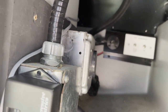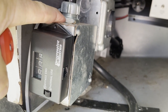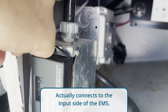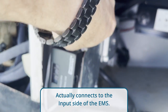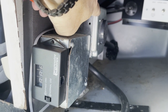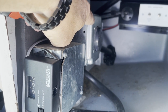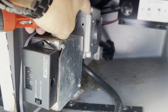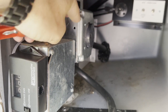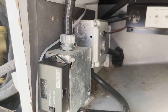So my connections are in this small bay here. Basically this is the junction box that connects the shore power cord to the electrical panel inside of the RV, and this is the generator outlet. This is where the generator electricity comes to, and this is where I plug my shore power cord in when we want to use the generator. So these two boxes are going to come out of here, and the source wires for the generator output and the shore power connection are going to go into the transfer box.